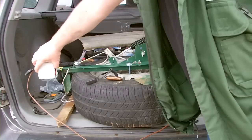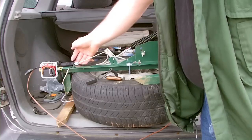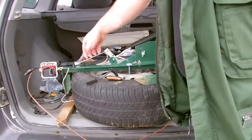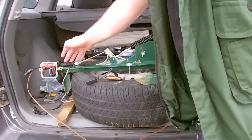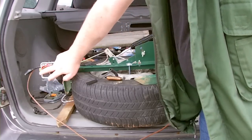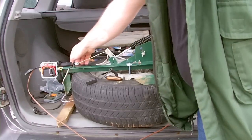Just coming down here to the unit now. Here you have your actuator — it's called a central locker motor. You'll find it in the panel of a car door, very cheap to get. It comes with this arm and everything, an arm for bolting on — it's very handy for this and it's all sealed as one unit. And in here is my wireless receiver, and inside that it has a relay for switching the power to the actuator.